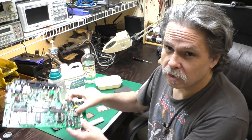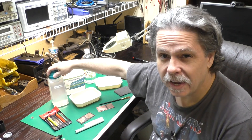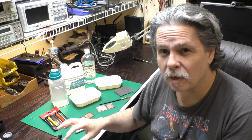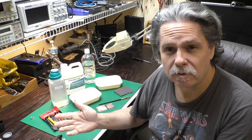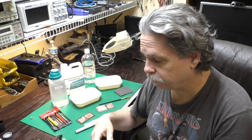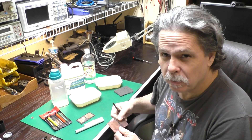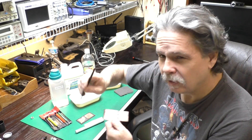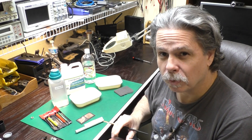I hope you found this video useful. When we have damage from leaking alkaline batteries, we can use chemicals such as vinegar and citric acid to neutralize the mess left behind, then clean that area with water and isopropyl alcohol to make it better than it was and allow us to fix the damage. In actual practice, you'd want to use a small brush over the area as the chemical does its job — this will break things up and allow it to work a little faster.